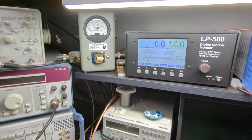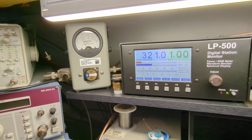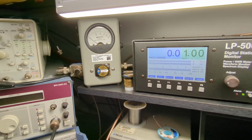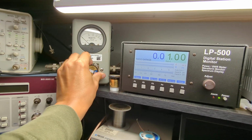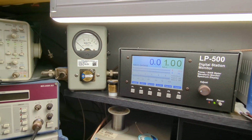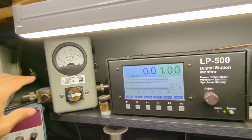I'll show you what we're doing for peak. Hello, radio, 300 plus, right? 1, 2, 3, 4, 5. Not bad. Here's our average, which actually, let me put in the 250. Let you see it a little bit better that way, because I'm not going to do peak over there. Let me show you average here. Average is always best to do on a Bird or an analog meter.